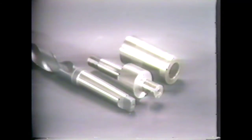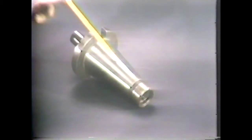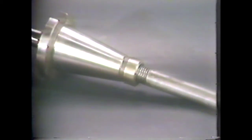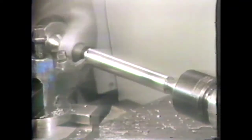On tools with a Brown and Sharp taper, the taper is approximately one-half inch per foot. These self-holding tapers are used for arbors, collets, machine tool spindles, and many other applications — you can find them in the Machinery's Handbook. The other kind of taper is the self-releasing or steep taper. These tapers usually exceed 16 degrees and require a positive locking device to prevent slipping. They release very easily and are generally used on machine arbors. There is an American Standard steep machine taper series charted in the Machinery's Handbook.